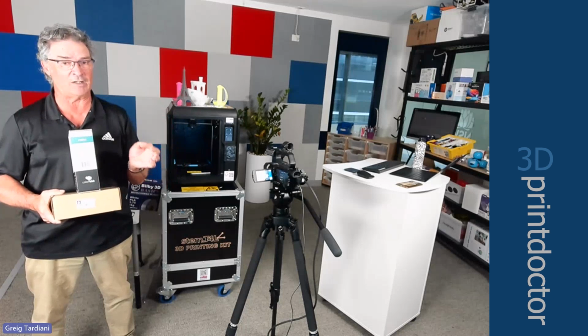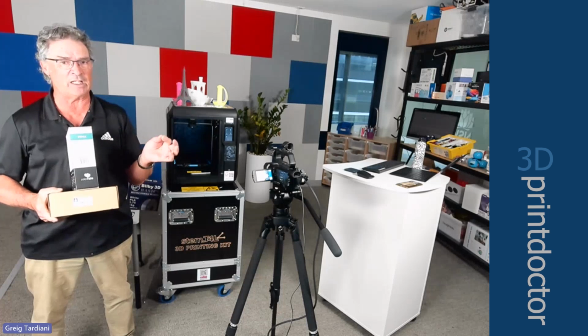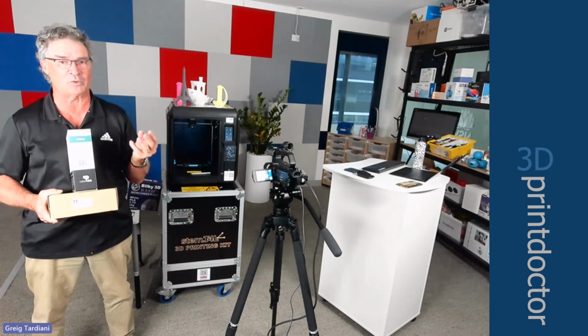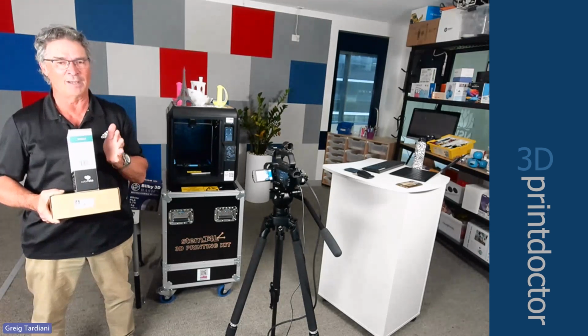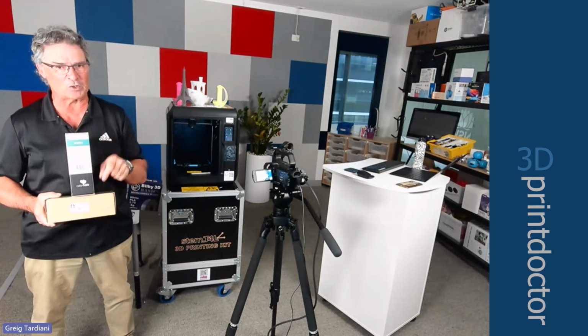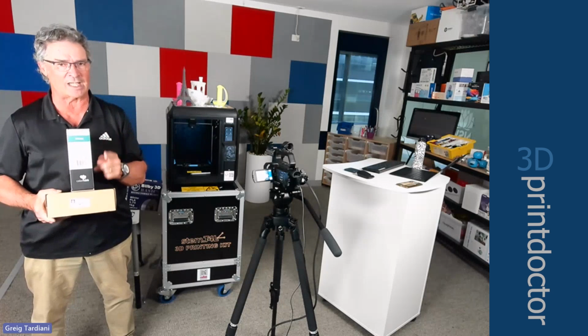If you leave it in there, especially the wood, these aren't quite as bad, the wood is the worst. You leave it in there, it'll block up in a couple of hours and your nozzle is useless and it's almost impossible to fix up and get back again. So if you use the wood filament, and I'm not saying don't because it's a fantastic product at the end, make sure that you're there for the end and you withdraw it. The bronze, copper, brass, the steels, etc., I would do the same thing.